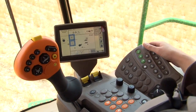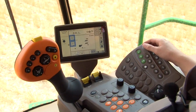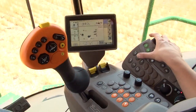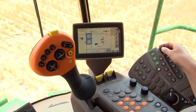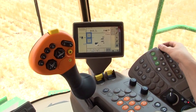If corn is not completely being threshed, increase the rotor speed up to a maximum of 500 rpm. These settings vary greatly upon the crop conditions. To adjust the concave clearance, use the threshing clearance adjustment button. Start out at 20 and adjust up to a maximum of 35, making final adjustments based upon crop conditions.